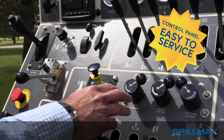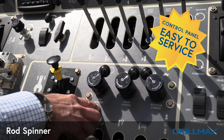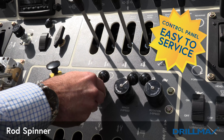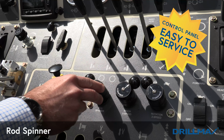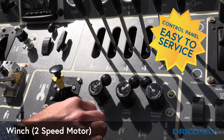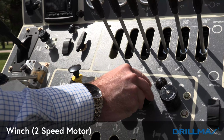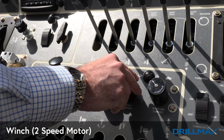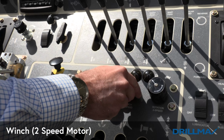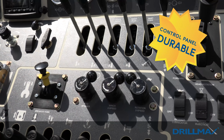Now we have some switches. So for a rod spinner works in two directions. So you can either spin rods together or you can spin rods apart. The winch on the DM450 is a 2-speed motor. So we have a high speed and a low speed. So when you're in low speed, you get the max pulling power of 12,000 pounds. And when you turn it to high speed, you double the speed, but you also cut the power in half.